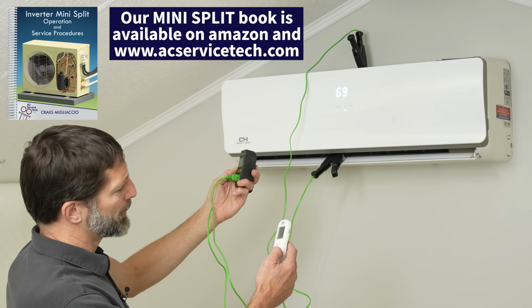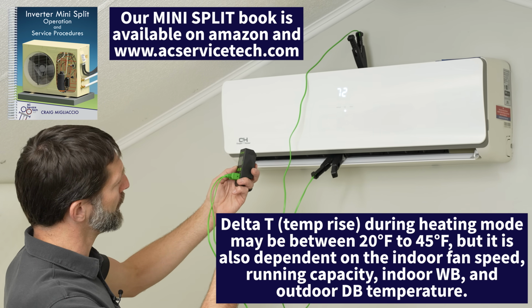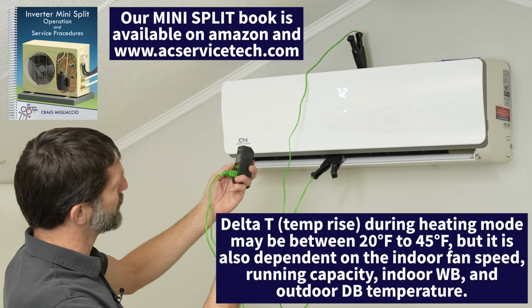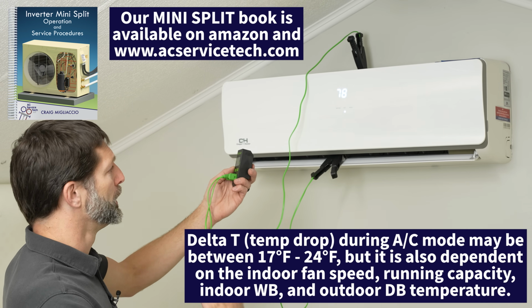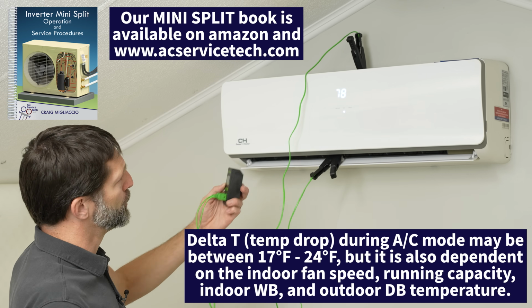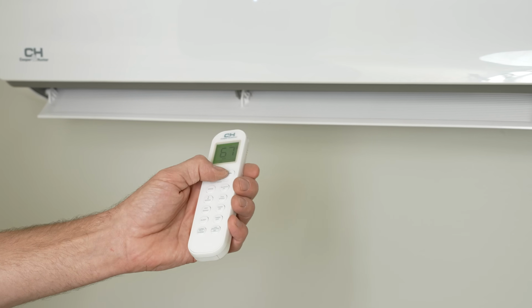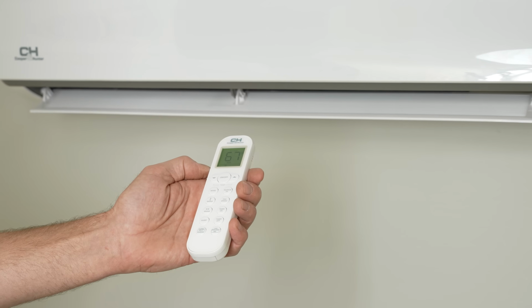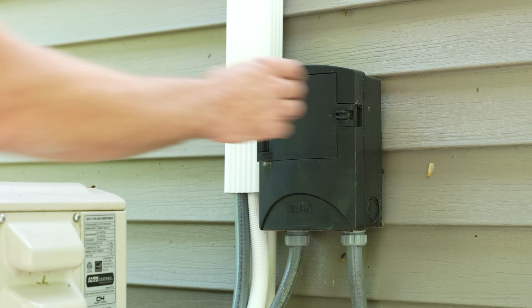We're just going to check this, make sure it's running well. We're going to turn the temperature up in heating mode, and then we're going to check the delta T as well. We can turn this to air conditioning mode, let it run for say 5 to 10 minutes. Once again, check the delta T in order to just see that the system is actually working. Now we're going to turn this off. And after this is done and the compressor is off, then we're going to pull the outdoor disconnect to make sure the power's off to this system.